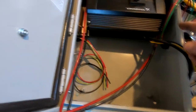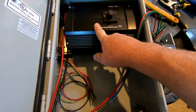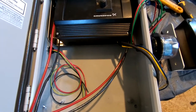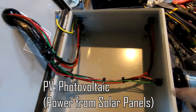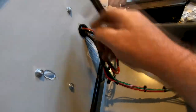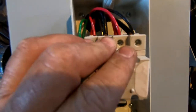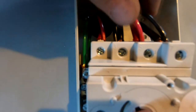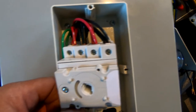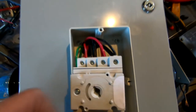Some of this power will go into this flex switch, which will then serve the well pump. The other power will continue out of the box down to the other box to serve the Wi-Fi system. I've got the two PV circuits and their surge protectors wired up together coming through here and into this switch box. As you can see, I've got two separate circuits — PV one positive and negative, PV two positive and negative — and their surge protection in-line right to the disconnect. Hopefully this will prevent any damage from this point forward in case of a lightning strike.